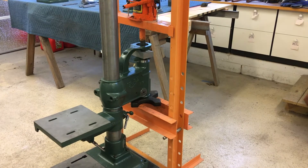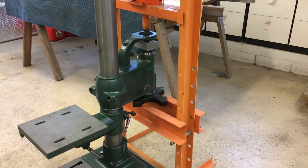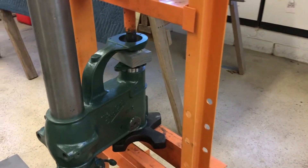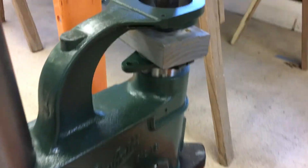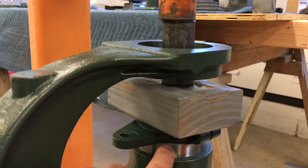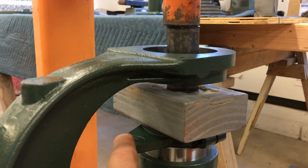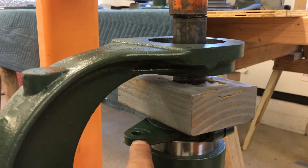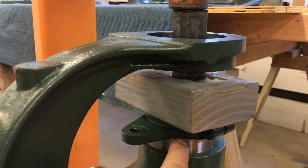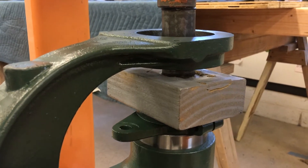The orange beast has made its way out of the back of the shop and we're pressing the bearings. Turned out pretty easy — turned it around and lowered it down and set it on the bottom. I've got the bearing in here with a little block and a piece of pipe to make up the difference. To press on just the outside and not the inside, I'm using the thing that goes on the bottom of the spindle to move it up and down — that fits just right on the outer race. So I'm going to press this in, put the shaft in, and then press the one on top.